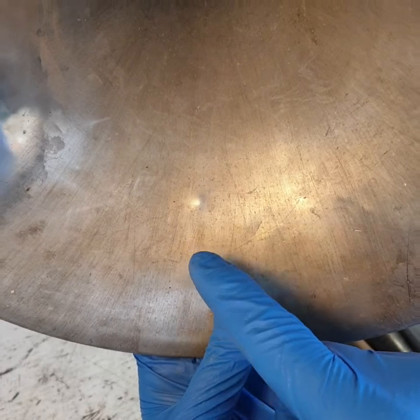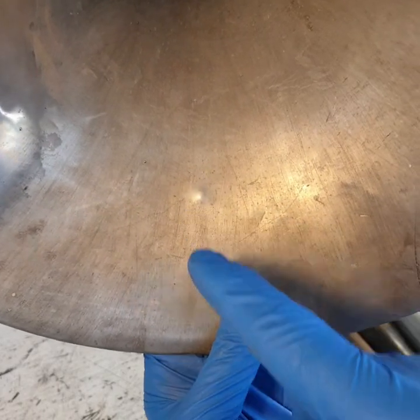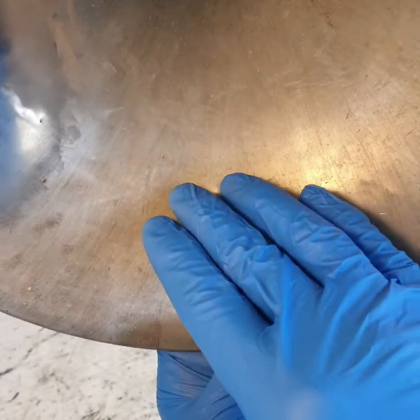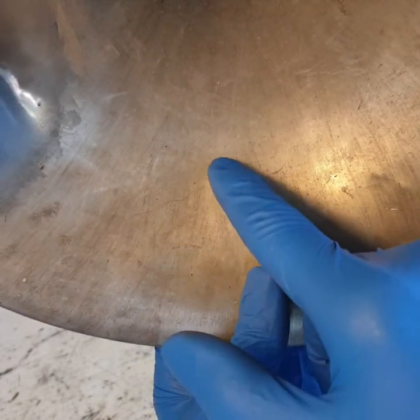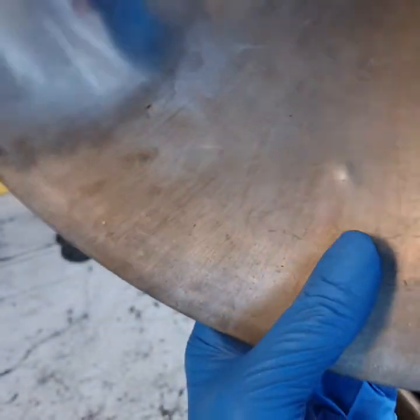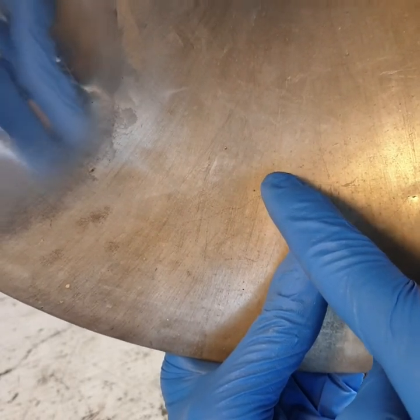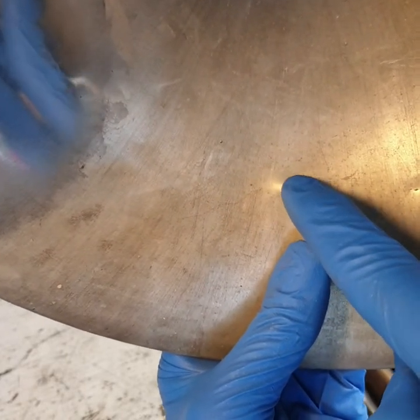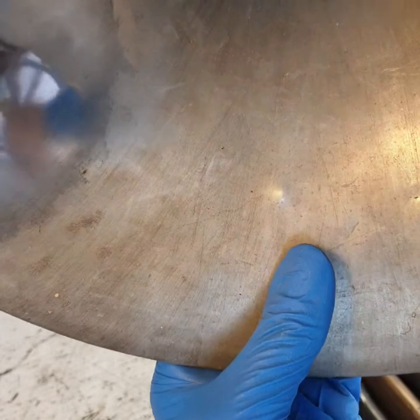So it's a difficult decision what to do first, whether to remove the dings or sand the surface to see what can be achieved. Because also, if you remove the dings before cleaning all the surface, all these little specks of dirt you can see here, there is a lot of dirt and aluminium corrosion. If you push here, you are going to embed those specks inside the aluminium. So you will finish with a rough surface, and you will have to buff much deeper than before. Okay.